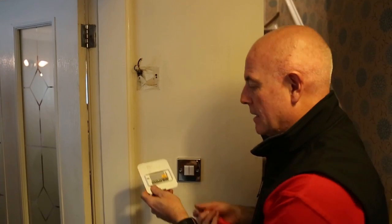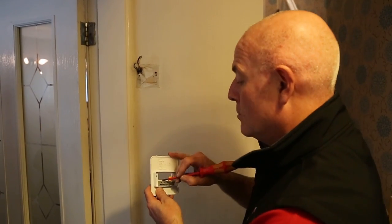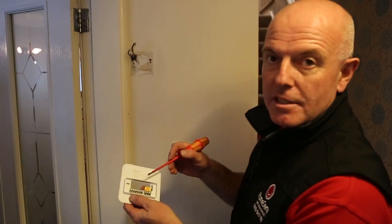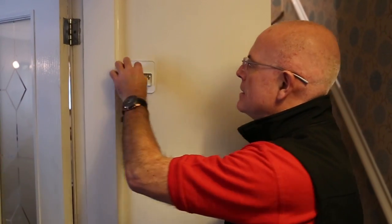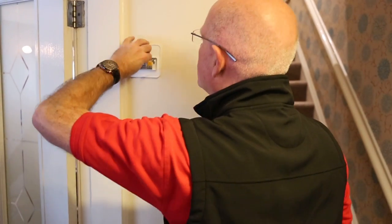And you'll see this is the tado back plate with its common, normally open and normally closed contacts, just like the existing thermostat. You've also got some spare ports here just to park any cables that you don't need. In this instance it'll be the neutral, it isn't required. So this simply slides over the top. So this is the neutral cable. This is not needed for the tado, so you can park that into one of the spare slots they kind of give you.